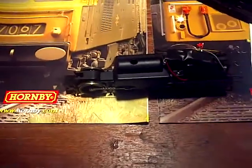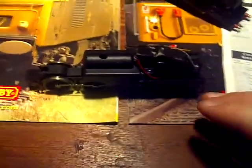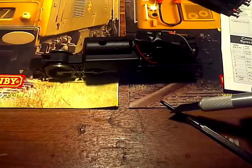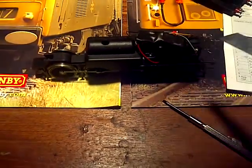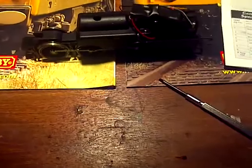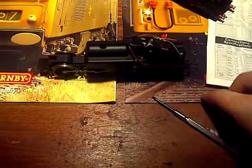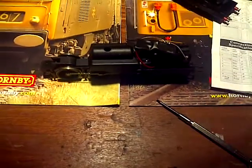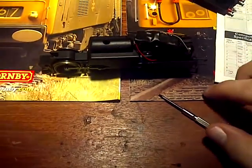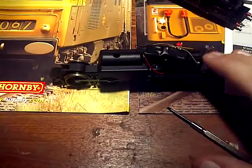With this type of wire, I don't really recommend using wire strippers. I find just using a normal craft knife works best — you make an incision and cut along it, then flip it over, make two little nicks on the other side, and there's your bare wire. For soldering these wires together, you will need a soldering iron. I prefer using a 40-watt one — anything higher isn't really necessary. That's pretty ideal for this work, as well as track work. You'll also need solder.